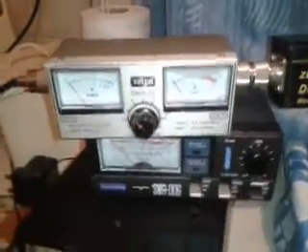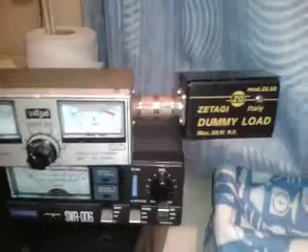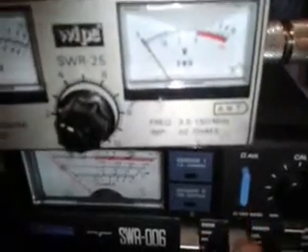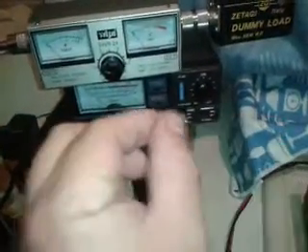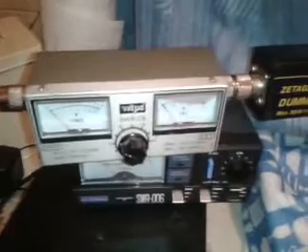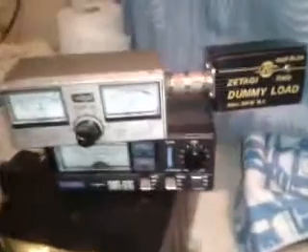You can also have faulty meters, and what normally tends to fail is the switches. Some meters have a switch that slides — forward to SWR — that type is renowned for playing up, especially if the meter's old. It's worth taking the top off, which is normally held on by a couple of screws, and spraying a bit of switch cleaner on the back of the switch. That will solve it. I've had my dial-type meter probably 20 years with very little trouble.